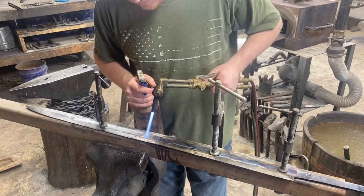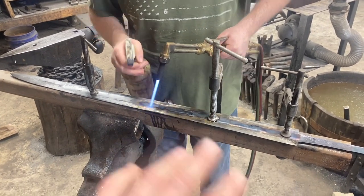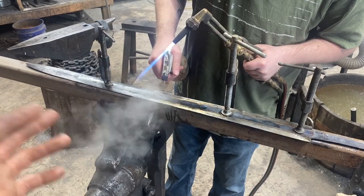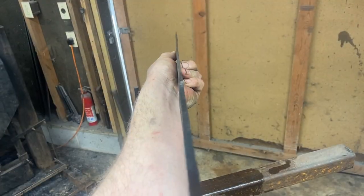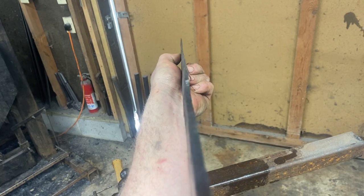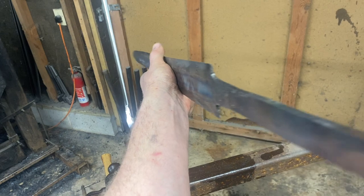So we're just working our way up the blade a few inches at a time, getting a nice relatively uniform royal blue on the fuller and a nice relatively uniform straw on the edges. We're just moving the clamps out of our way as we go. After doing the torch tempering, the blade's good and straight now. There's a little bit of waviness on the edge, but that's just from the grinds being uneven — that'll all be smoothed out as we take it up the grits.